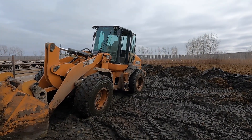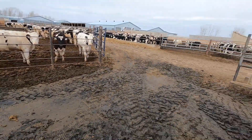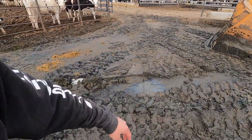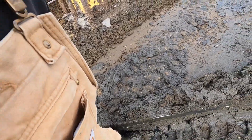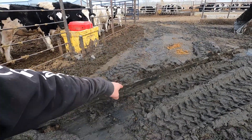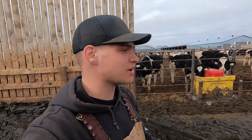We opened up our next corral — it's another mud pit. But right behind the water bowl here we got the concrete pad, it's also behind the feed bunks there. We do this in every single one of our corrals. Except you can see here there's a little bit of gravel still from last year, but right here there's a gnarly drop-off — I mean it's probably at least a foot, maybe a foot and a half right there. So if I was to back the wagon over this ledge, it's either going to break the tire or maybe break the concrete after the wagon's full. I have to put some gravel there before I back the wagon into this corral, so we're going to grab the wheel loader and do that, and then we'll back the manure wagon in and start hammering away at this corral.